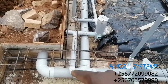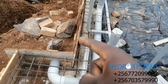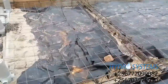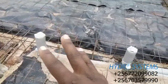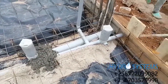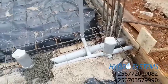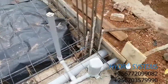They will then join with what is coming from this side of the laundry area into the vent, into the duct which is going to be around there. Also, this one here is another bathroom's washing floor trap which is going to collect water from the shower area. It will join this one which collects water for general use after mopping. The water from the hand wash basin also joins into the floor trap and goes outside. This toilet also goes straight outside.